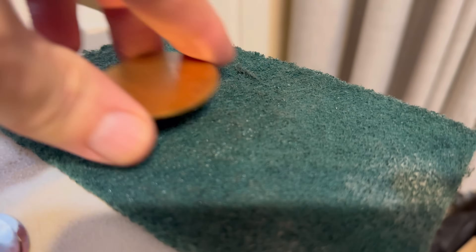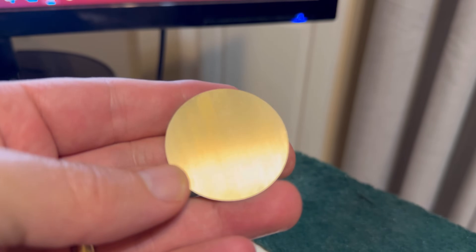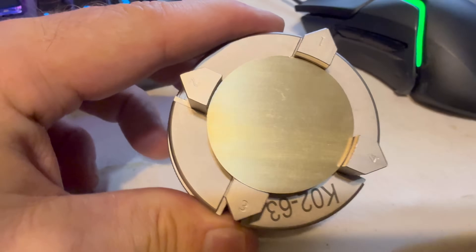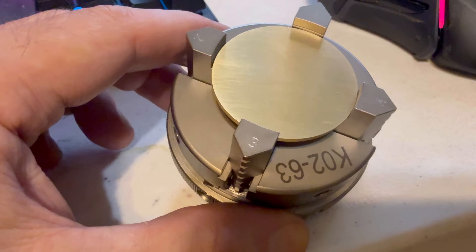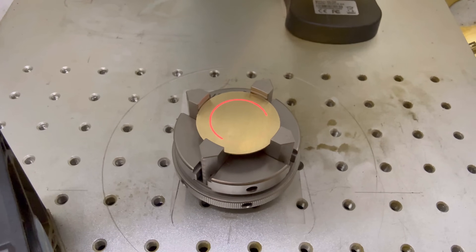Because I don't like putting anything polished in, I always use a rough material to give it a brushed or satin finish. I already did it on this one — you just push it against there and rub it back and forth until you get a nice satin finish so the laser doesn't reflect up. I failed to do that once on a brightly polished surface and it reflected the laser and melted the top of my enclosure, which was made of vinyl.